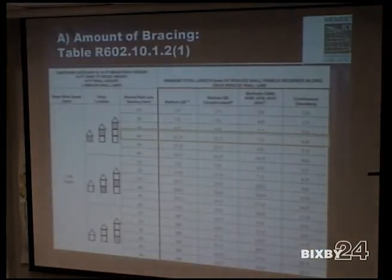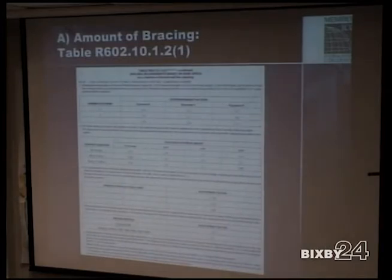So, when you go back to this one here, this was your jumping off point. This is considering 30-foot mean roof height, 10-foot eave to ridge height, 10-foot wall height, and 2 braced wall lines. So if you go on to this one here, what if you're under that jumping off point, that starting point? Well, you get reductions for those, and they're based on, see, exposure category B is 1, so anything over that, you're getting hit on. Anything underneath the starting off point, you're going to get reductions for. So it's either an increase or a reduction.